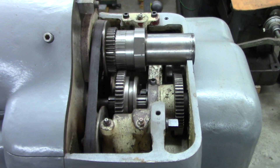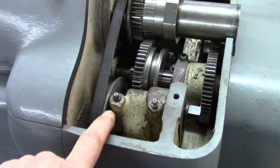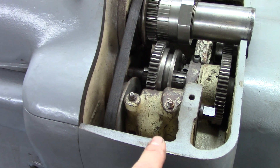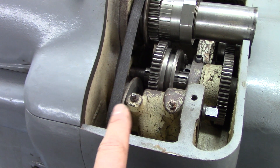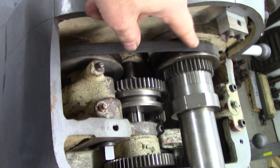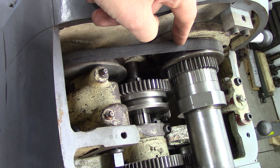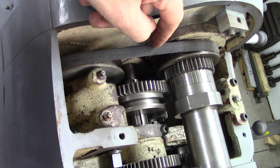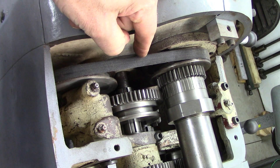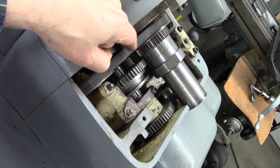I was thinking about doing something else — fixing that bushing, maybe replacing it with a needle bearing. If I do put a needle bearing in there, it has to be a hard shaft, like 60C. Instead of having this belt drive off the spindle, I think it's belt drive for slippage — if you jam something up, the belt will slip. I think it's for safety.